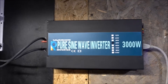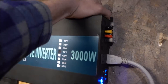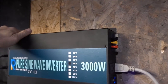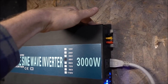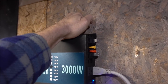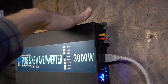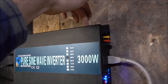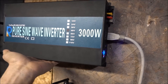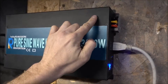These Chinese inverters really like to passively cool. There's a little bit of heat coming out of the vent up top - not super fond of that. You've got to feel with the back of your hand because you can't really feel it with the front. There's definitely heat in this area, but no heat anywhere else. The bottom side is fairly cold, the front is warm here.